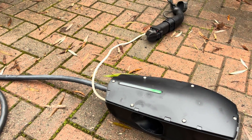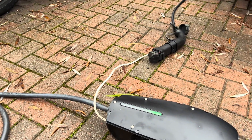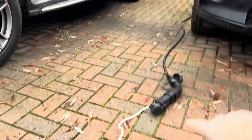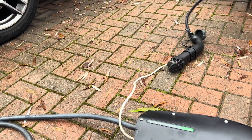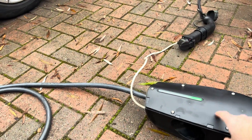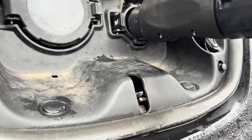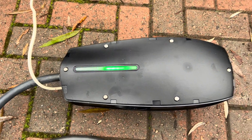I've rigged this up to test — I've set it to 6 amps so I can use a standard mains cable, and I'm using my other Tesla charger as a test bed. I've got a 240-volt output adapter going into this charger, and I'm also using a Type 1 adapter to test this on my Nissan Leaf. I'll take the connector — charger's going — car's charging. Safe to say, that is fixed.